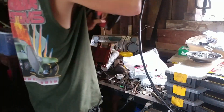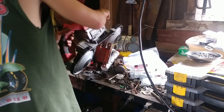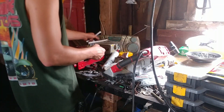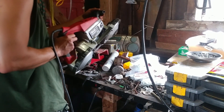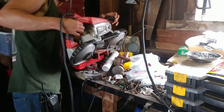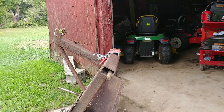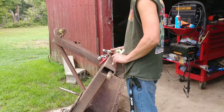I've actually had pretty good luck with it — haven't really had any problems. This is some pretty thick heavy-duty stuff to be cutting, and it seems to be cutting it fine. I think that bandsaw is 11 amps. It's a deep cut — you can do about four to four-and-a-half inches, maybe even five inches wide and deep. This C-channel came off a hydraulic tank for one of those ladders that automatically extends — it has a hydraulic pump on it. That was all free; we had a neighbor getting rid of it who was going to scrap it, and I said I'd take it.